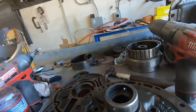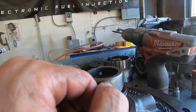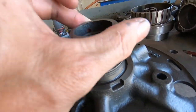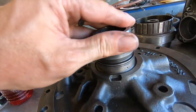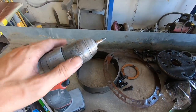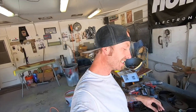We've got that drilled through. This is the factory hole with the chamfer on it, and this is the new hole drilled straight through. Here's my finished product — I chamfered the edge enough that nothing grabs when you rub your finger on it. I used these cheap Harbor Freight diamond tip bits — basically crap, but the cone shape worked. Put a little grease on it and worked it around. Good enough for my race car.